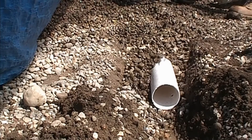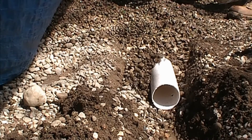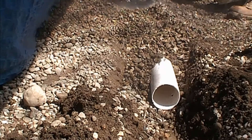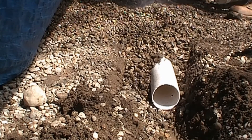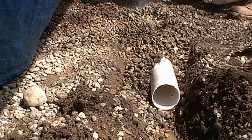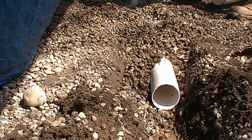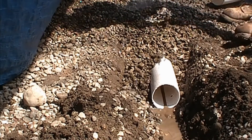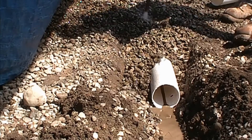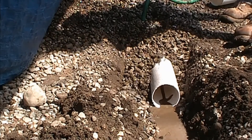Now let's simulate by putting the garden hose out here and see how long it takes for the water to get through the pipe and through the gravel. We're simulating a pretty good rainfall — adding water to the gravel. The water goes down through the gravel to the bottom of the trench and will eventually begin to flow. It flows through the gravel first because there are voids in the gravel, but as we add more water it will start to flow through the pipe.